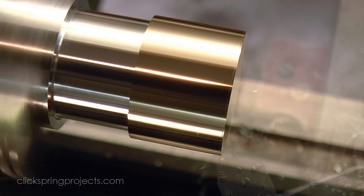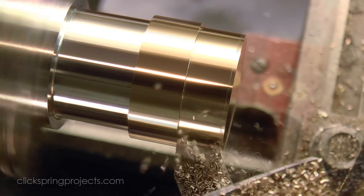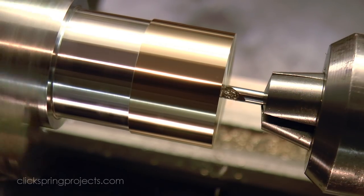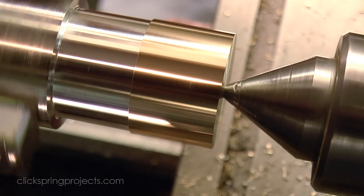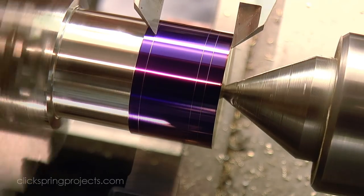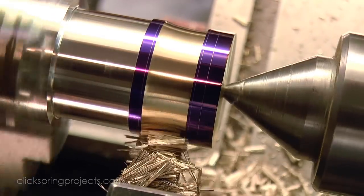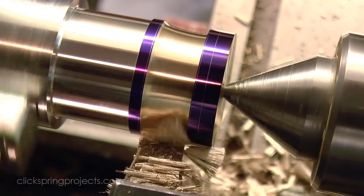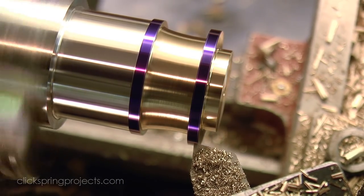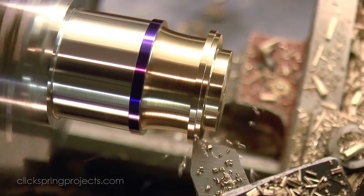At the most damaging end of the scale are the aerosol-based products. To begin with, the liquid itself isn't a stable lubricant, but more of a solvent. What oil it encounters, it effectively removes. And on a first application to a mechanism tightly bound with old oil and grime, it might even give the appearance of having done some good. But in reality, it sets up the preconditions for future damage to the mechanism.